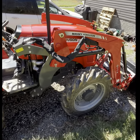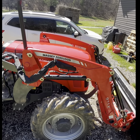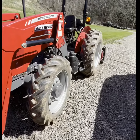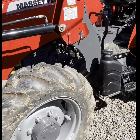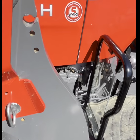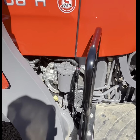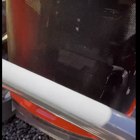I haven't really done a whole lot with this thing maintenance-wise. I've greased everything on the loader and underneath, and I've changed the oil, which isn't too bad — pretty simple to get to. I'm pretty sure it has two drain plugs in the oil pan underneath. The biggest aggravation is trying to put oil in it on the side because you can't really get to it because of the loader. But other than that, it's not really that big of an issue. It has plenty of power.